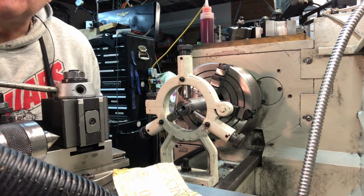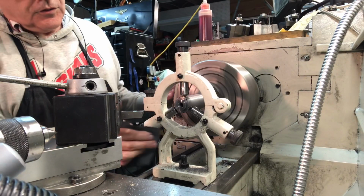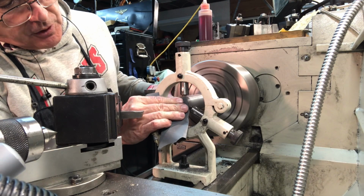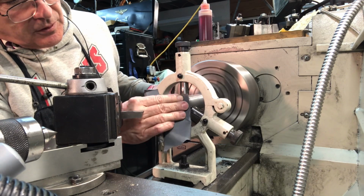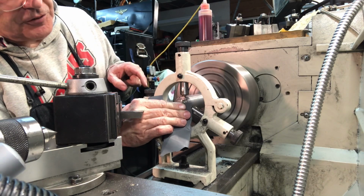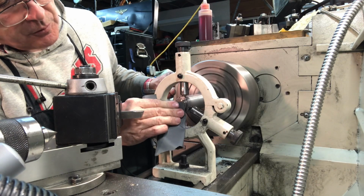All right, I'm going to turn the camera off here and take one final pass, then we'll take it all apart. Okay, I took a couple thou off just to clean it up. Now I'm polishing the face of this with the 400 grit emery cloth sandpaper as well. It looks really pretty. I realized while I was getting that vibration, which I couldn't figure out at first at the higher RPM, that the jaws are actually offset because I have 4 jaws gripping a hex nut. I was a little worried about the lathe at first, but I think we're fine.